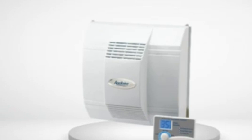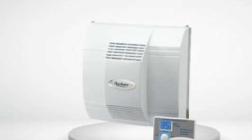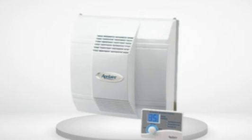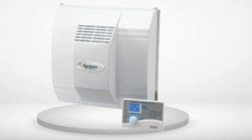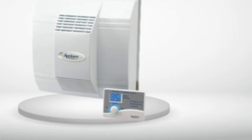Here is a problem caused by the following. First, my furnace fan waits one minute after the heat call to start running, but the humidifier is already on and is blowing humidity into the system. Second, my basement is unfinished and the humidity inside the return duct goes down rather significantly — for example, if the house's relative humidity (RH) is 40%, the return duct might be 30%, yet once the furnace fan starts running, the RH stabilizes at the house RH. These two factors may create a very short run of the humidifier.